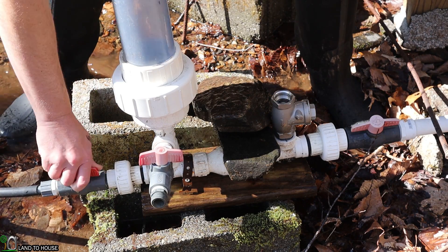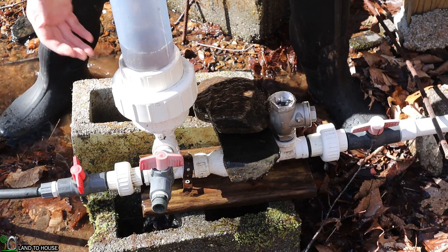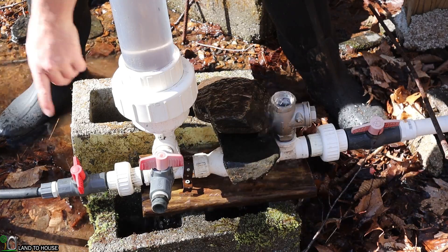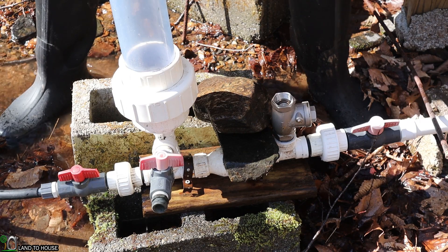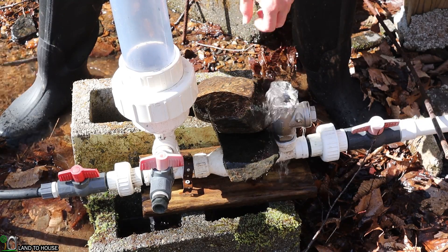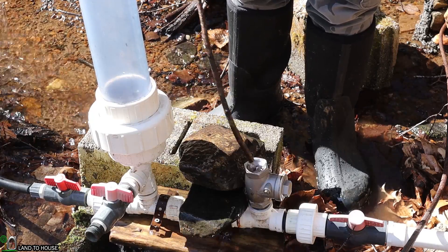Now we start cycling the waste valve. I close off the delivery pipe and the pump will cycle on its own quicker, building pressure in the tank. The pump seems to be working just as we want it to — but when I open the pipe again, the pump stops because we lost all that pressure and the water was shot uphill. I have to sit here and press this valve probably up to 100 times to fill the pipe full of water. Once it's full, this pump will operate on its own. I recommend a good valve pressing stick so you don't have to lean over. When the valve starts getting easier to press, you know you're getting closer to the pump working on its own.